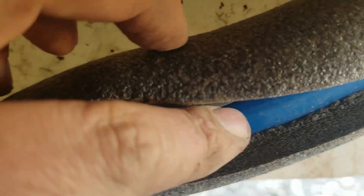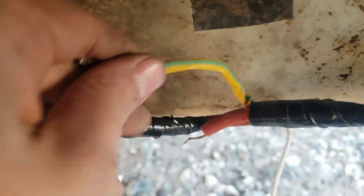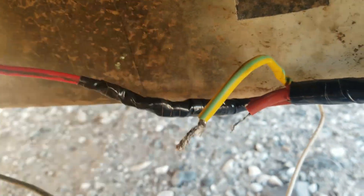I've got the wire run in here — there's the heat tape, there's my water line, and then we've got this insulation. I'm going to tighten it up just a little bit here, but it runs all the way up. That eraser-looking thing is the termination of the heat tape, so I'll flip it around so it's at least covering that little bit of blue right there. I'm splicing into my heater wire right now — I've got the positive on and I just need to get the negative, and we'll be ready to go.